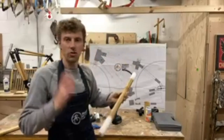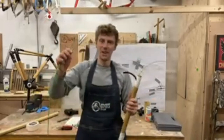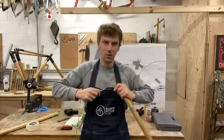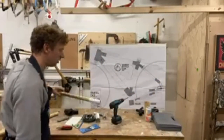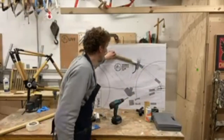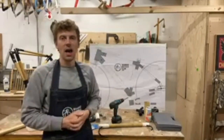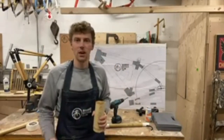You want some excess but not too much, so where I've got too much I'll just trim that off. That is my internal cable — it will sit in the frame like that. Obviously if you're going down the down tube you'd do both sides and use a bigger tube. The final tip I would always do is test: fit a housing through and just test that it fits really well. If it doesn't fit through, start again. You can see it's all gone through — that's basically how you do the flax cable.